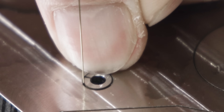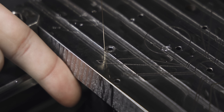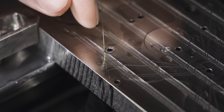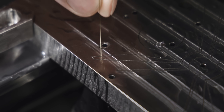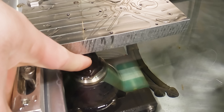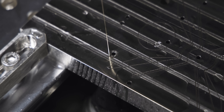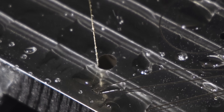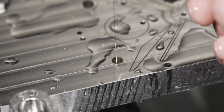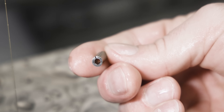We just got done cutting this off and the slug is sitting in there loose, but there's no way to really grab it and I can't reach underneath. This is non-magnetic so I can't use a magnet. The only option would be to come in through that hole and hook it out, but we're actually going to use our lower flush jet and shoot this slug out of our part. And there's our slug — shot right out of the hole. Now we can get back to machining.